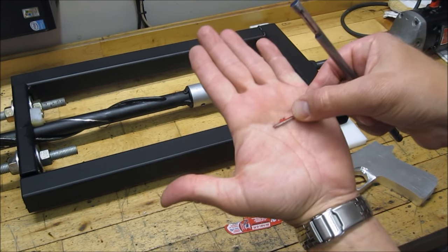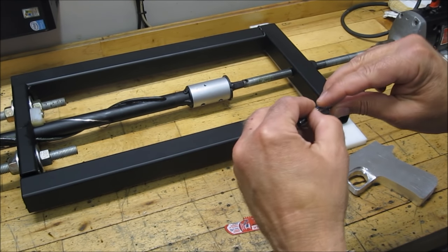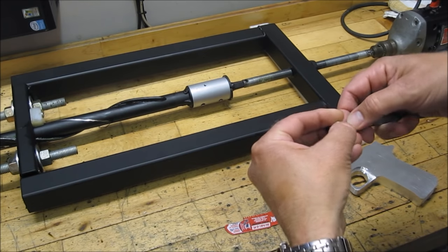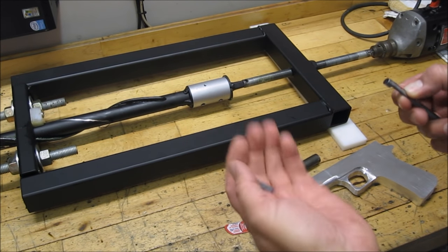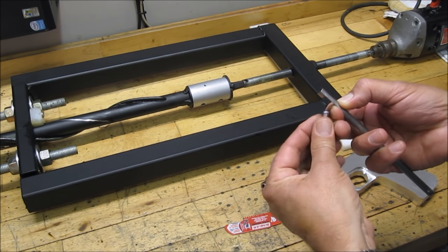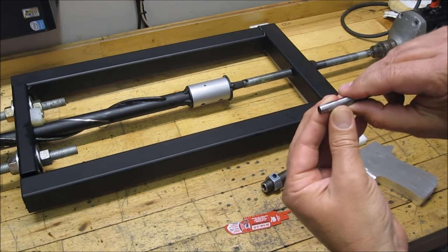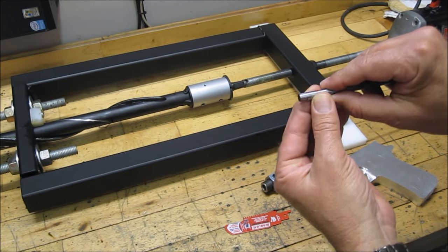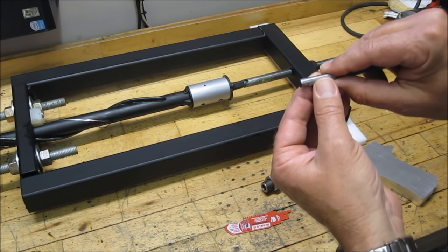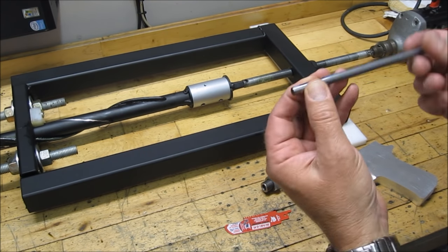A little tiny piece with two teeth left on it — that'll slip into the slot on top of the shaft. I have a little half-round piece that I filed out that matches the corresponding notch on the bottom, and with paper or shim stock I'll be able to increase the diameter to press the teeth tighter against the barrel, or deeper into the barrel, to produce the grooves I want.